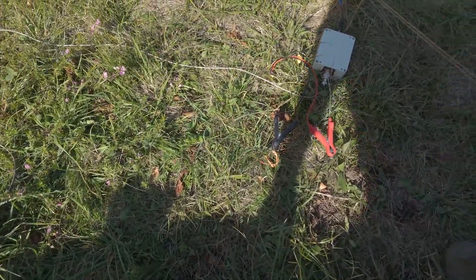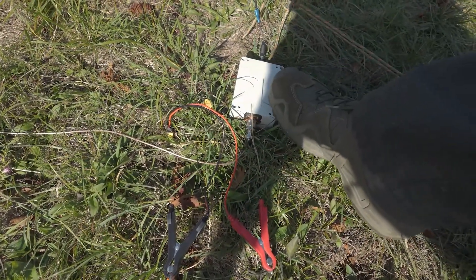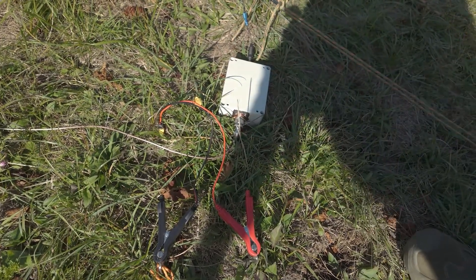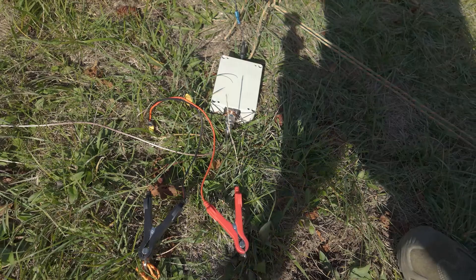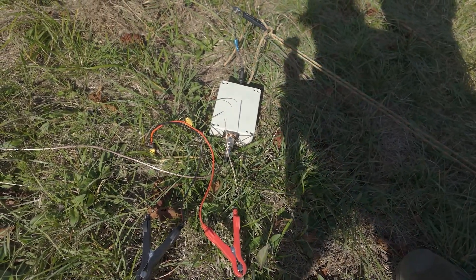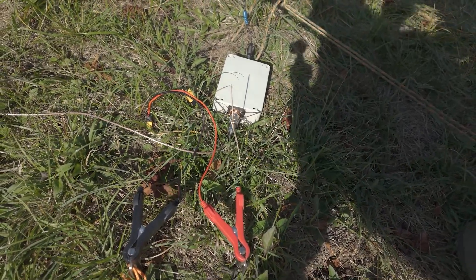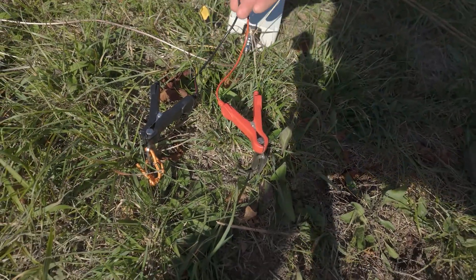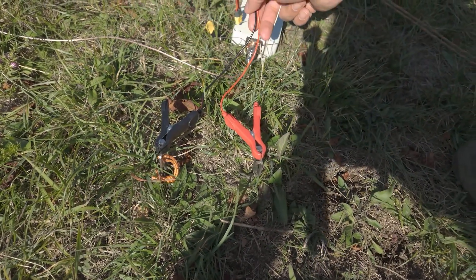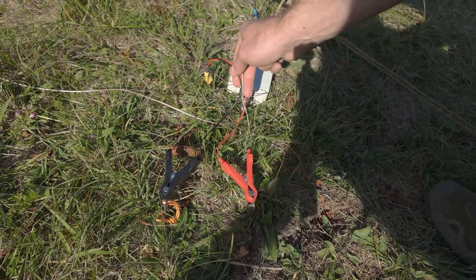Here is the transformer box. One guy said we should not put this below the antenna feed points, but this is nearly on the ground. It's a little bit hard to do — it's not really directly under, it's a little bit to the left. It's connected with this connector. We have two ground rods and we are testing once without this and once with.